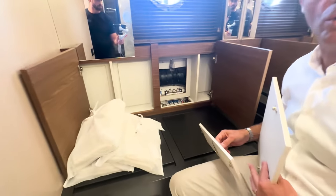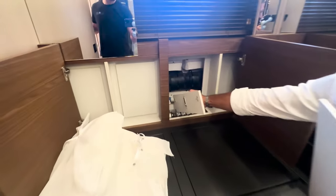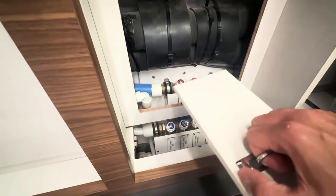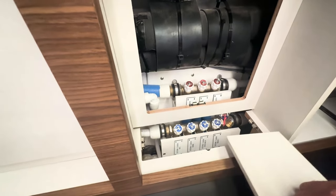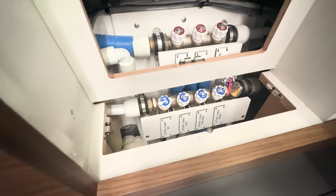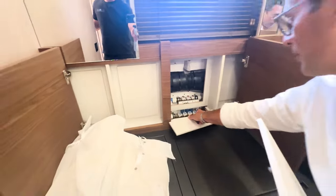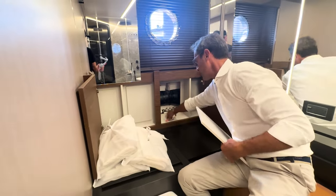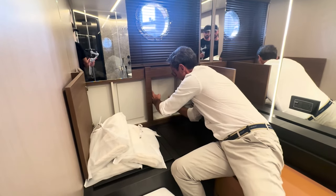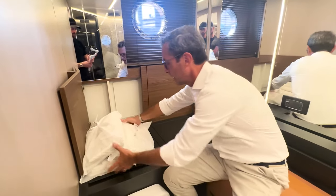And you can also see the level of quality. I always like to show backstage, so you see every pipe is insulated. Those are hot water pipes, completely insulated. You see also the one going down there, so they don't lose temperature on their route to the final destination. Instead, that's cold water, and you see that it's not insulated. Everything is labeled, you see, that tells you exactly which manifold controls what. And then when you are done with your maintenance, you just close it back, put it back, and then you're done. The same goes there, there are other manifolds. So this is technical space.